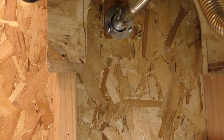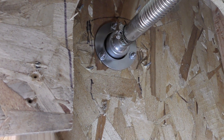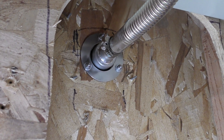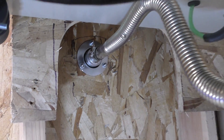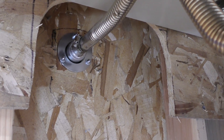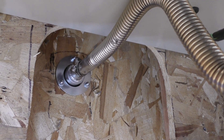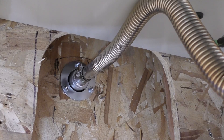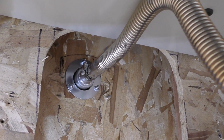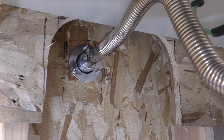The other piece I had to buy is a three-inch flange coming out of the wall. Those flanges are actually built for boats and RVs to protect the siding from the high heat of the exhaust tube — they insulate it so that whatever surface they're touching doesn't get hot. Whether you're screwing into fiberglass or a vinyl-clad motorhome exterior, it's designed to handle the heat without melting those materials, and it works perfectly for going through wood as well.